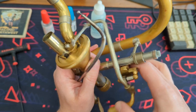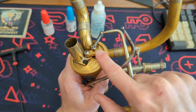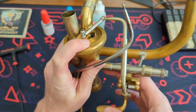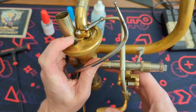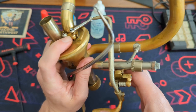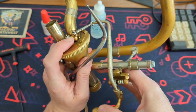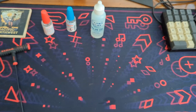That is now basically at 100%. If you don't find anything when you do it in one position, also hold the stop arm in the activated position and do the same thing. It's good to do both, or maybe in the middle somewhere, and feel what is moving. Even with everything tight, there's just about a thousandth of an inch of movement before anything happens.